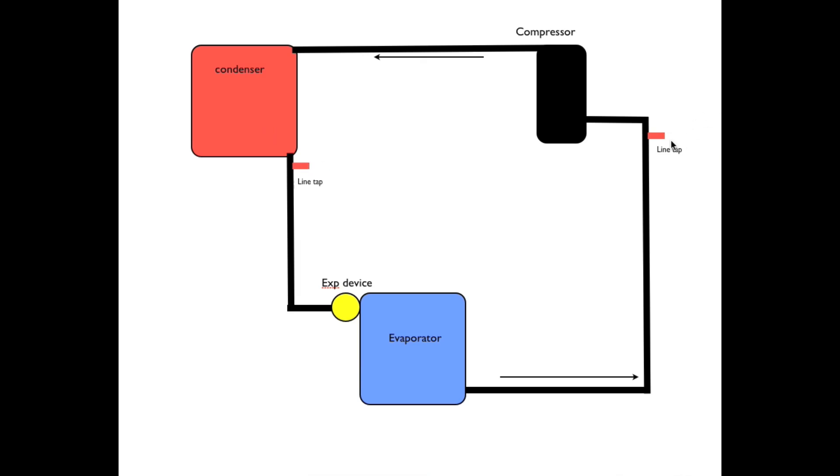Once I put my refrigerant in, I'm going to run it up to just about atmospheric pressure. Then, when I begin my next evacuation, I'm going to take it out of the high side — not the low side port, just the high side port. Because around that tap is where all the non-condensables have been pushed when I put refrigerant into the low side. I suck it out from there, get it down to about 20 inches of vacuum. When my gauge on the low side shows 20 inches of vacuum, I'm assuming I've pulled out most of the contaminants, and then I open the low side and finish the job.